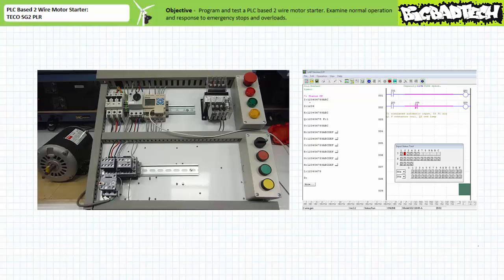Let's now examine its behavior during emergency stops and overloads. When the selector switch on input 1 is closed, the F-contactor coil is energized, the F-primary contacts close and the motor turns on. Again, you'll note the red pilot lamp briefly blinks on, indicating there's a transitory period where output Q1 is being asserted and the F-contactor hasn't fully closed. While in operation, opening the e-stop directly depowers both the field input and output devices without reliance upon any programmed instructions to do so. The F-contactor coil is de-energized, the F-primary contacts open and the motor turns off. If input I1 is in the closed position when the e-stop is reset, the F-contactor coil is immediately re-energized, the F-primary contacts close and the motor turns on. Let this be a cautionary tale about the limitations of emergency stops in two-wire control circuits: if the two-wire control system is re-powered with the automatic input being actuated, the system can spring to life without warning.